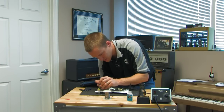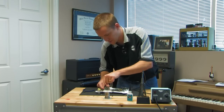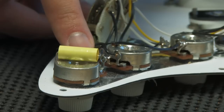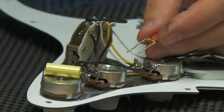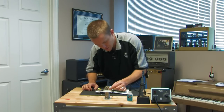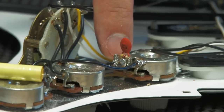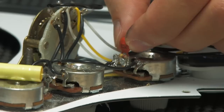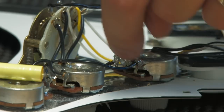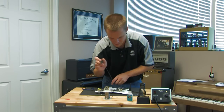Go ahead and make my connections here, being careful not to ground out the leg that's going to the tone lug. Now I'm going to install the volume mod onto the volume potentiometer between these two open lugs. I clipped it short so that we don't have excess wire hanging out. I soldered one side only — the side going to the switch — leaving the other side open because I still have to connect the wire from the input jack to the center lug, so I don't want to close my solder connection and have to open it back up again.